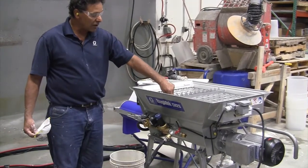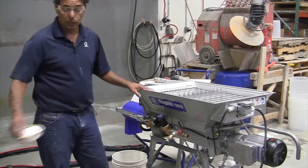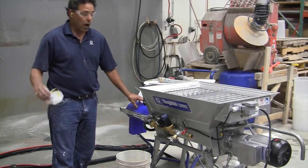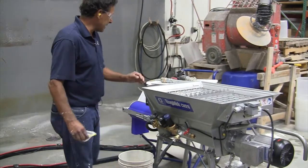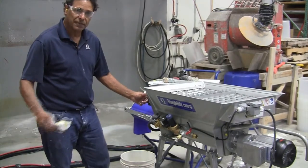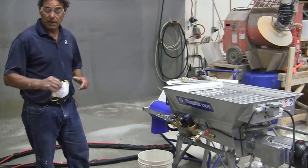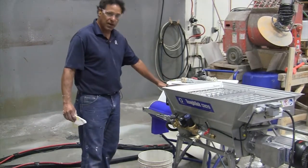You never want to get the hopper down to the point where you can see the auger. If you do, the auger is no longer taking material in but is still adding the preset water dose, so you're going to get wet material. Always make sure you never see the auger — if you get behind, simply turn it off and add more bags. The hopper holds between two and three bags at any time, and one person can easily keep up at a pallet an hour, breaking bags into the hopper.